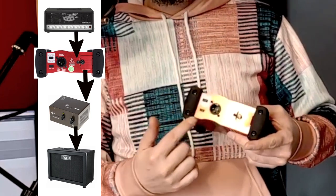I have this Behringer DI box — pretty awesome piece of gear, pretty old by now, still works. It has an input and a direct out. I plug the amp head in here, and this goes to the load — to the attenuator and then to the speaker. On this side I have the XLR out, which goes into the console to record. My point is, I am grabbing the signal from the amp before it even hits the load. We'll get to record exactly how the power amp reacts when it has a static load connected to it, and then how it changes when it has a dynamic load connected to it.